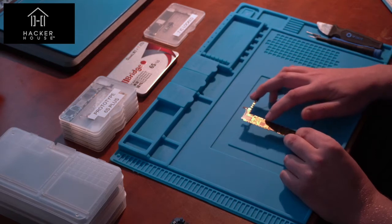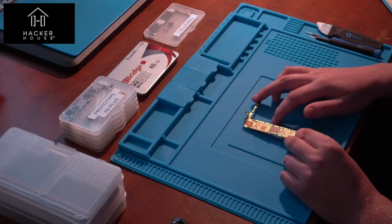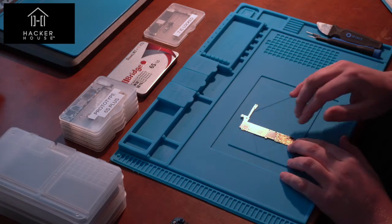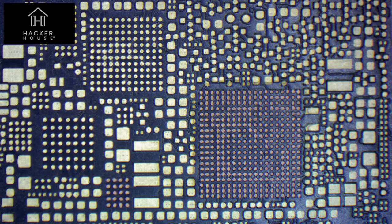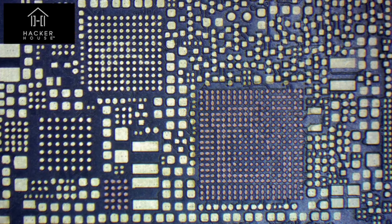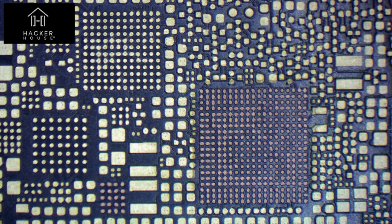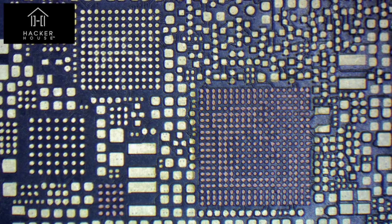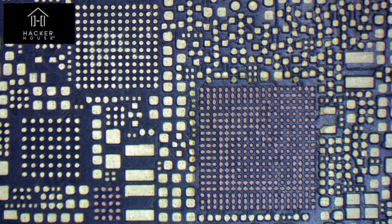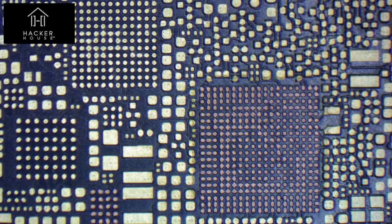A lot of these ICs are mostly associated with the radio interface, and there are a number of different components wired up on there. If you dig around on these boards you'll see just how small they can really be. Under a microscope, you'd really struggle if you wanted to hand-assemble something like this. It's typically assembled with robotic machines using a solder mask — a human might intervene to move or amend a component, but assembling a board of this nature by hand requires immense skill.